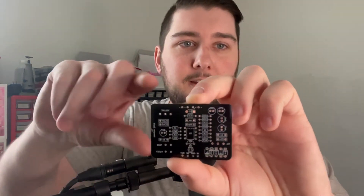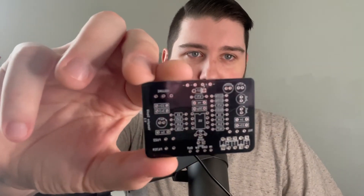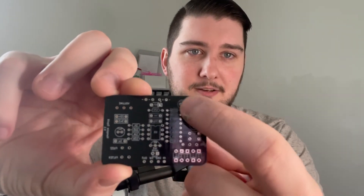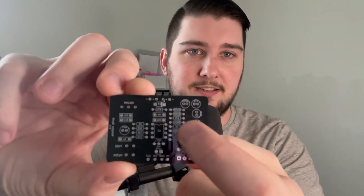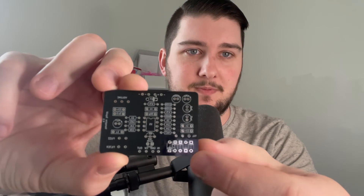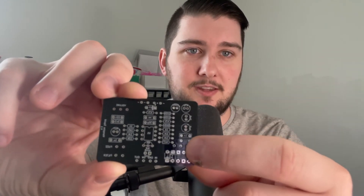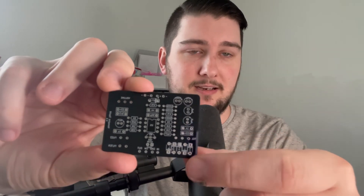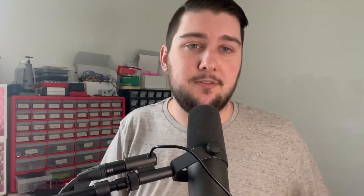We made another version of that same circuit board with some minor changes, just flipping the traces going to legs two and three of the transistor, and we came up with this — our current board. We're also currently working on a version two. Right in the middle you can see where the IC goes; you have resistors here and here, and then your diodes here. This is where the toggle connects so you can select between silicon, germanium, or op-amp clipping. That's what we're currently working with.